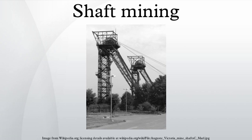The second compartment is used for one or more skips, used to hoist ore to the surface. Smaller mining operations use a skip mounted underneath the cage rather than a separate device, while some large mines have separate shafts for the cage and skips. The third compartment is used for an emergency exit; it may house an auxiliary cage or a system of ladders. An additional compartment houses mine services such as high-voltage cables and pipes for transfer of water, compressed air, or diesel fuel.